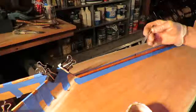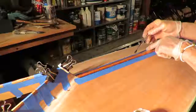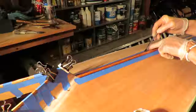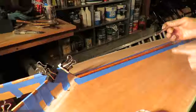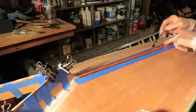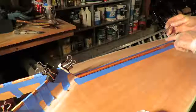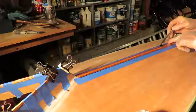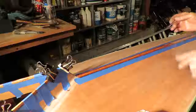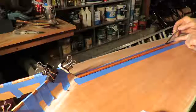So you want to coat the back side of the veneer and the top of the deck in that narrow, just over 1/4 of an inch gap that we've left there at the crest of the deck. Okay, and we are closing the gap, so to speak, as far as being almost finished with all of our epoxy work and ready to move on to varnishing, which is awfully fun. So back deck goes quickly. Laying the mylar skin over the back deck is quite a fast process and fun, and so we are getting close.